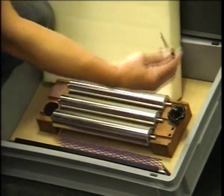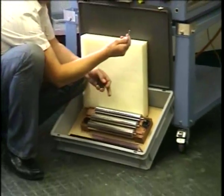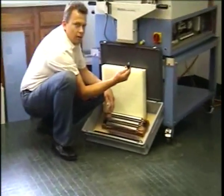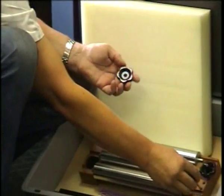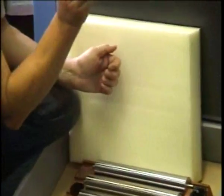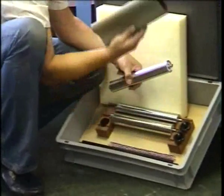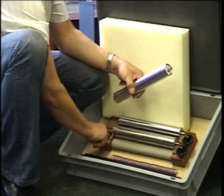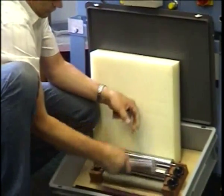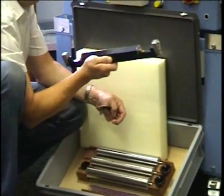Then we have a lever. Actually, the lever is for a paper foil frame, so not everybody will have levers like these. However, these we call star handles, and they're used to tension the fabric on the frame or whatever substrate it may be. Also in here is a tool. This is a tool for the blanket to adjust the rubber blanket, and the rubber blanket is actually underneath here. This is a rubber blanket. And then we also have standard side dams. They mount to the blade. And the last thing here in this box is the actual doctor knife shape A.